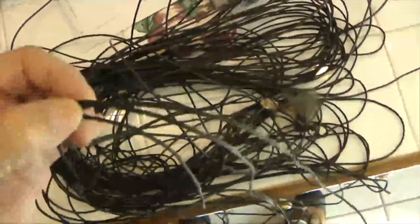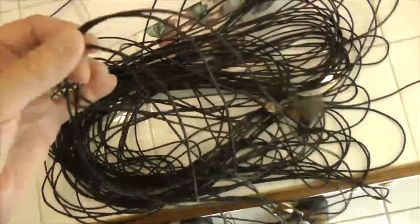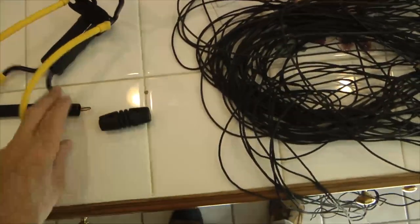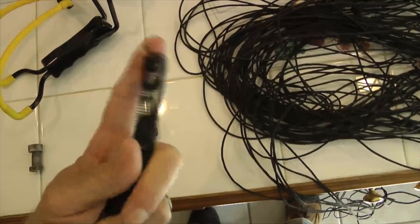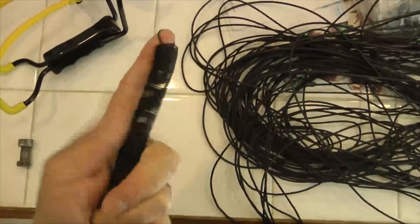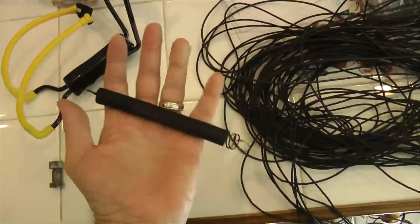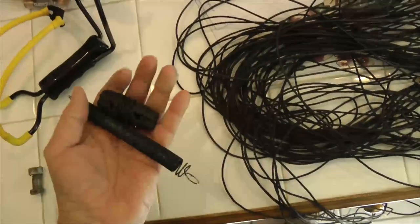I have some tar string — a sort of tar layer, I think it's nylon. I'm going to tie that to the fishing string and bring it back over the tree. The tree is going to act like a pulley. I'll have an insulator hooked to a spring. I want something flexible so when the wind blows it won't break my antenna. I got this spring at Home Depot and sprayed it flat black, simply because silver would show more. I also painted my insulator flat black so hopefully it won't be an eye catcher.